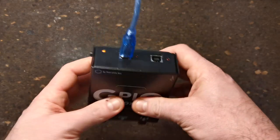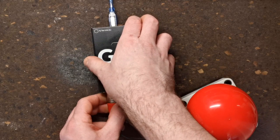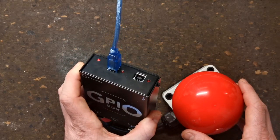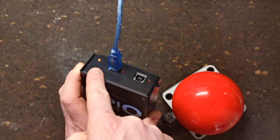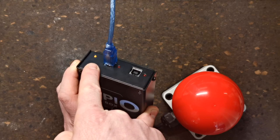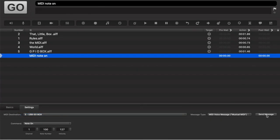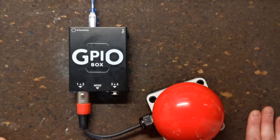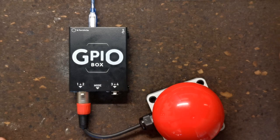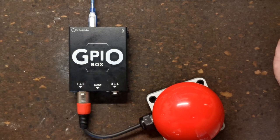To enter learn mode, power up the box with the switch in the center position. You will see that the status LED on the back of the GPIO Box will begin to blink slowly. This blinking indicates that the box is waiting for you to tell it which button you'd like to assign a command to. Plug in the button you'll be using and press it — for an illuminated button you may need to press it twice. The blinking will stop, and the box is now ready to accept a MIDI command. Select the GPIO Box as the MIDI destination in whatever software you're using — I'm using QLab — and send your desired MIDI command. Once the command has been received the LED will resume flashing, and the box is ready for you to select another button and repeat the process. Once finished, flick the mode switch to your desired setting and your box will output your custom commands.